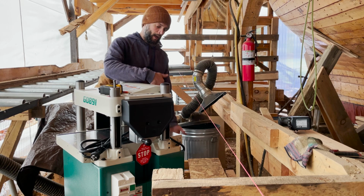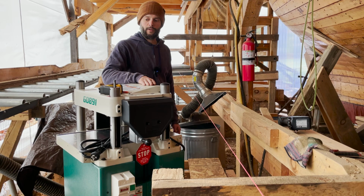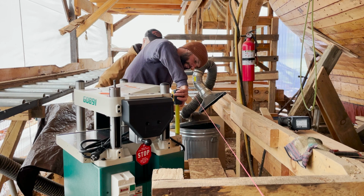And the base of this machine is a lot taller than on the Delta. So we ended up removing a bunch of material here where we had this cribbed up. So we have this about the right height for this machine. We just have a line here that's strung from the bandsaw over to our outfeed tables. And this is the height that we want the table. So right now, if we measure from the base here, the table is just about 30 3/4. That's close enough for us.